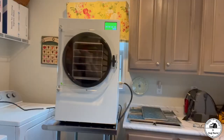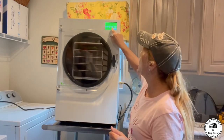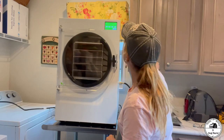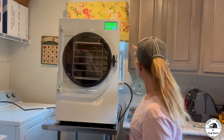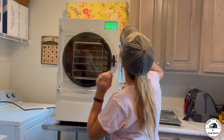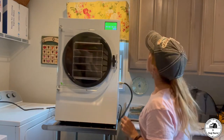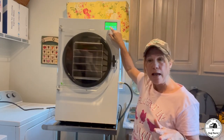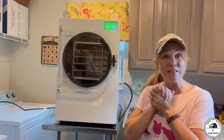We're at 39 minutes, so that's run successfully for over half an hour. The next thing they're asking me to do is toggle on the vacuum pump — the oil pump down here — which I'll do right now. It just switched to on. I'm going to watch it run for another half hour; there's a number up here that says 'pressure' and that number is supposed to come down below 500 in about half an hour. We'll come back and hopefully we'll have some success.